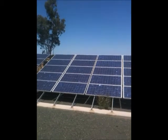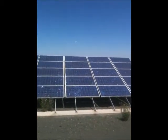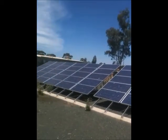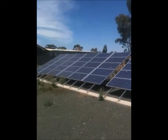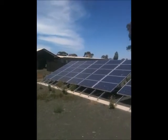It is made up of two SMA 5 kilowatt single phase inverters. And these are BP polycrystalline panels — they are only 165 watts, hence why there are so many panels. I'm not sure why they did use polycrystalline up here, as the data says that monos work a lot better in these high sun areas.